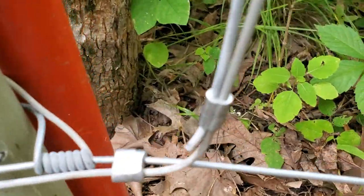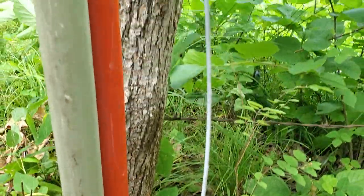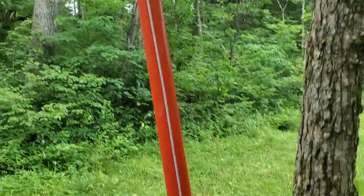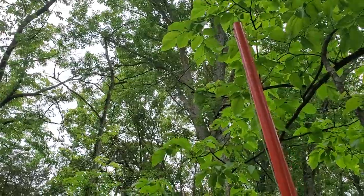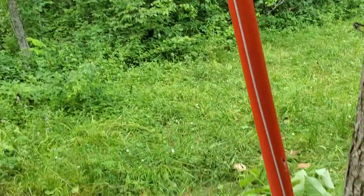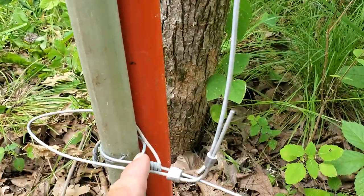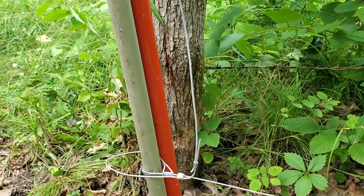This is aluminum, not steel. These right here — the C23 crimp — that's what made our connections from one wire to the next. Ben and Isaac ran a wire over the top on a foam-filled fiberglass post — you can use PVC — bringing it down the post all the way down. They put a crimp on it right here on each one, so there's no way that overhead wire is going to come off. It's all one continuous loop.